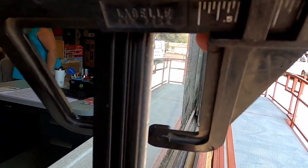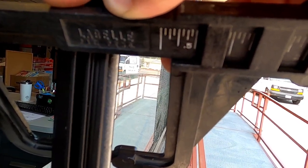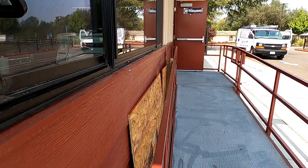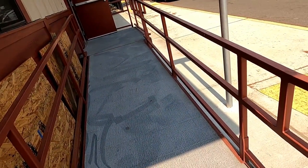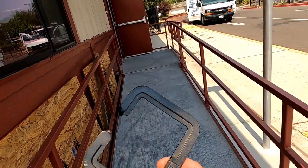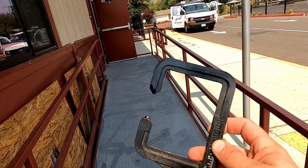You can read your overall thickness right here — this one is 9/16 inches, which is kind of unusual, but some window brands are 9/16. Usually it's half inch, three quarters of an inch, or one inch. This tool will give you an accurate reading. I'll put a link in the description below where you can buy it.